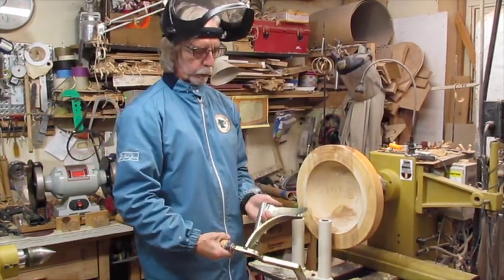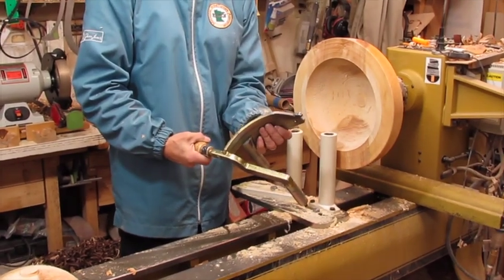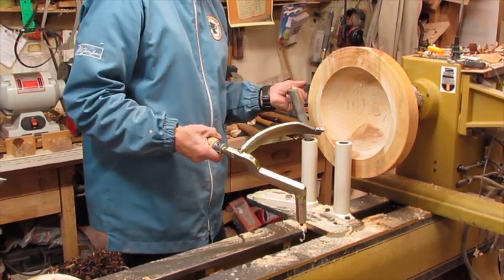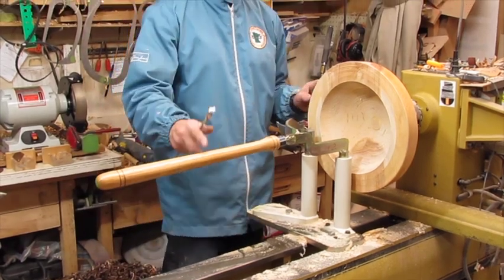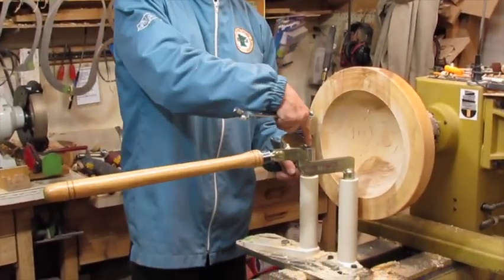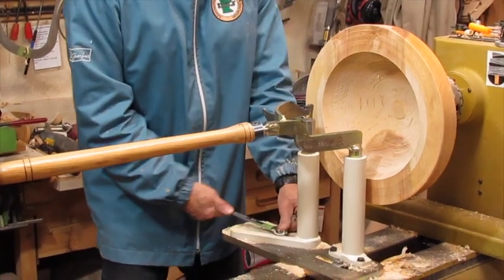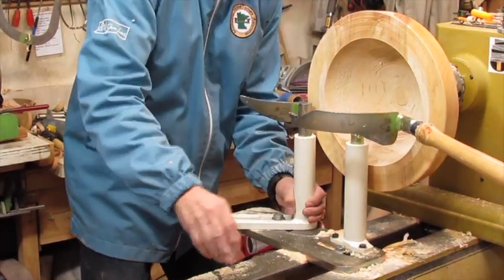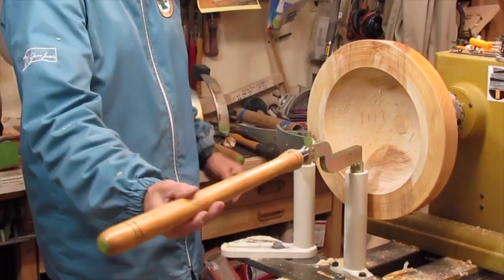So here's my number two knife, and each knife set is a set because it comes with the support arm and the cutter. We have the Korpro cutter installed on this one, ready to go. So we just drop this in. The only thing we need to do now, you can see this is without changing the base at all. I'm right there to cut my next core. I just have to move this out a little bit so that I can get the support of this post here. So I'll just lock that in and we are ready to cut again.